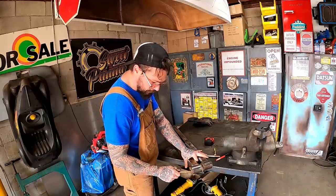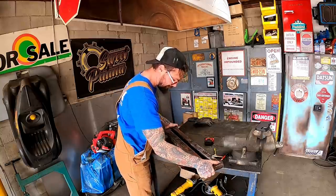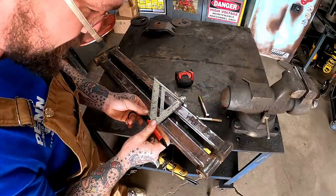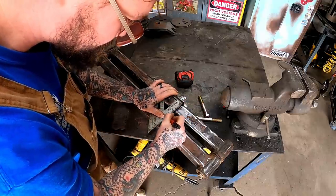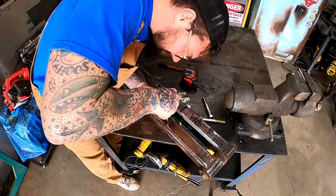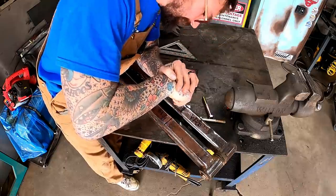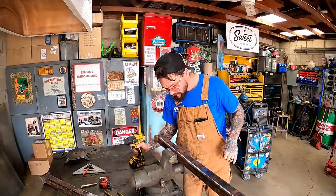Let's line these up with some bolts here. Oh, line up good. The speed square never lies, baby. Boy, how many damn markers I got out here? All of them. I got all of them. Mark center. Take a spring-loaded punch here to take the guesswork out of drilling. Drill us a pilot hole.